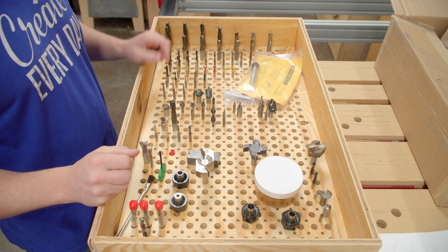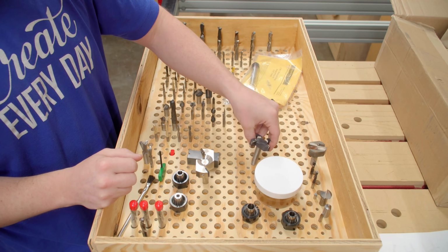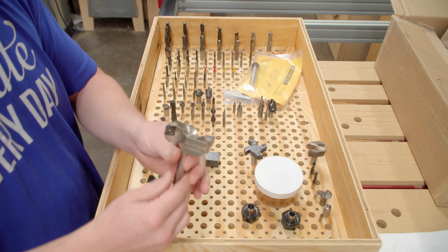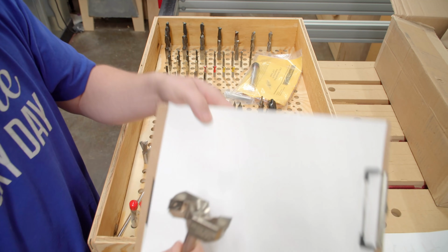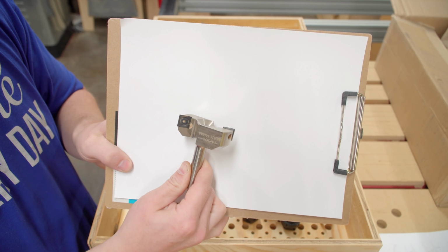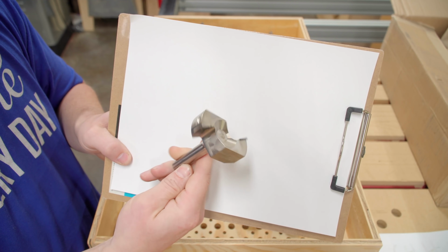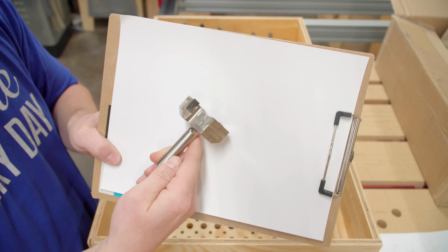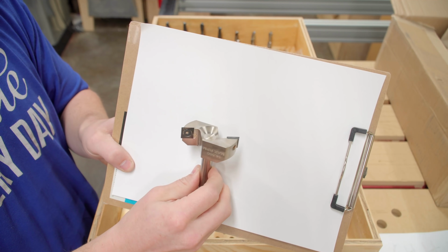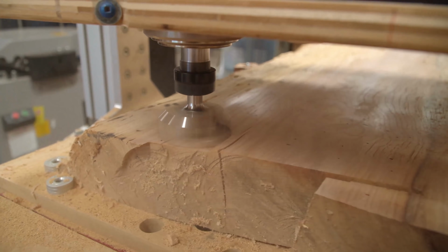Slab flattening, right? I've used an Amana bit, I've used an old bigger Whiteside bit, and now my go-to best performing bit by far is this monster. Now you need a decent spindle to push this thing. It's a 2.5-inch diameter carbide insert bit. It is a SB, oh, what is it? I used to know this. SB25-2 flattening bit. And this thing, I just released a video testing this out for the first time.